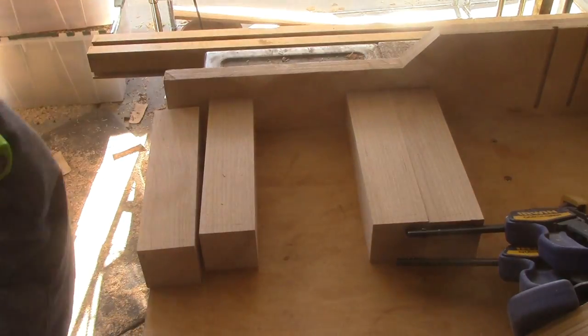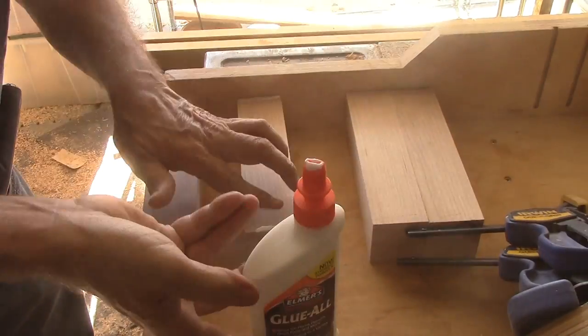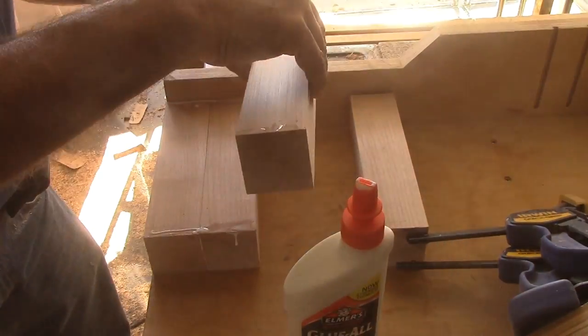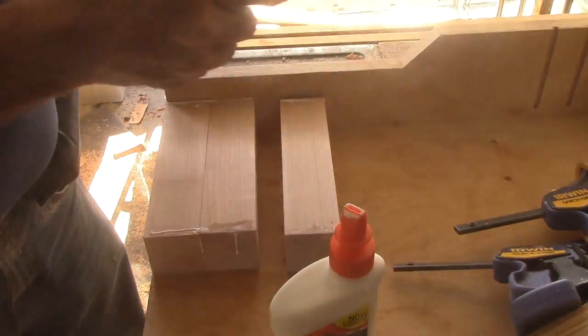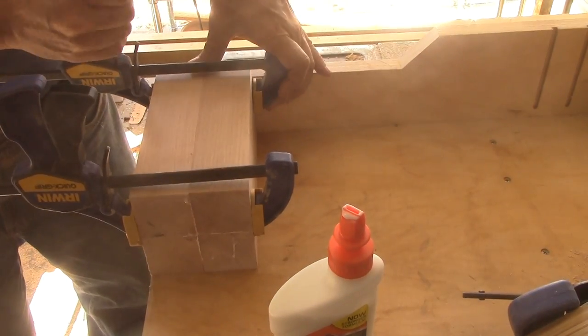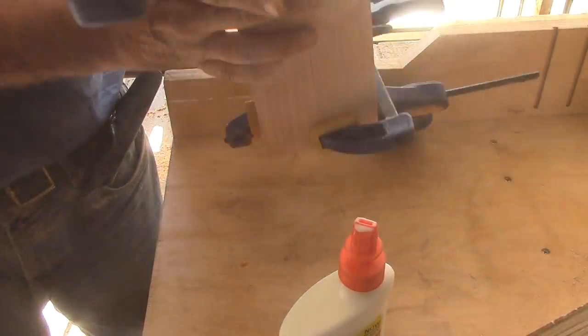I've prepared four square pieces of two-inch maple about ten inches long, trying to have them as square as possible. Next I'm spreading white glue on only the last one-half inch of wood and gluing the four pieces together. I don't like the craft paper alternative as it has a lot more cleanup later. This way, I'll saw off the half inch that has glue and not have to clean up the surface.